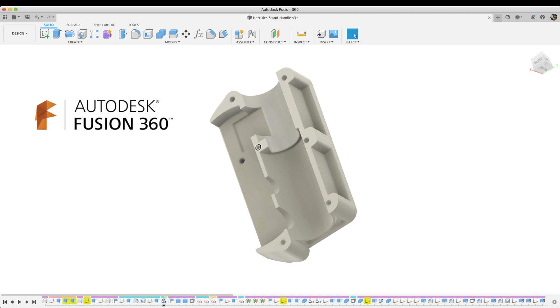The two sides clamp tight around the lower pipe, but leave clearance for the upper pipe to move up and down. There's a fixed bolt head on the lower pipe that just fits in here — it also acts as an anti-rotation feature, that's why it doesn't tighten all the way. A bit of play here is fine. This opening here locates the fixed end of the lever spring. The spring actually touches the metal pipe — the plastic is only a guide. This other recess here is to allow extra clearance for the guide and the locking pin. It's a bit wider than the handle, which keeps the handle from falling out if the pin should ever get lost.